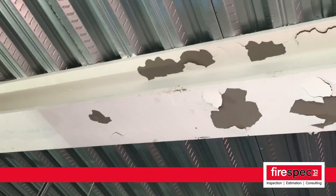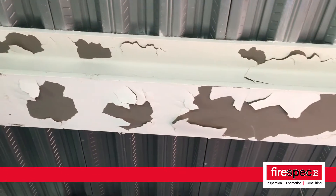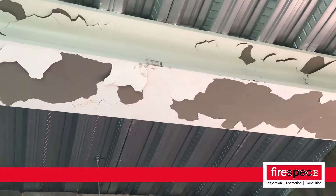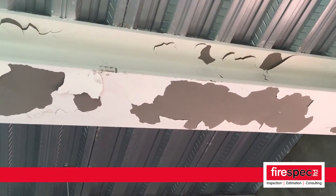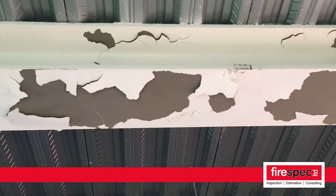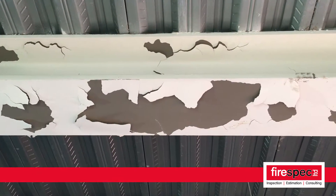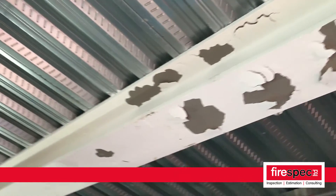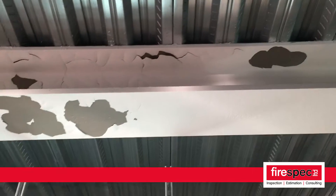This area hasn't been abraded. It's also been applied during the winter — it's cold, there are early dew points, and there's a lot of humidity around; it's in Scotland. So what we think has happened is this intumescent has been applied possibly in the afternoon and the conditions deteriorated very quickly after application. Moisture got through the film and into the surface, and as it dries out and warms up, the evaporation of that moisture breaks the film apart and cracks it down. Possibly there was even moisture on the surface during application — it shouldn't have been, of course, but sometimes moisture is invisible.